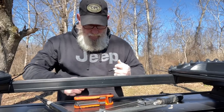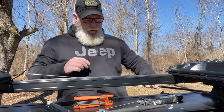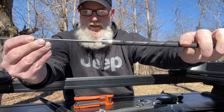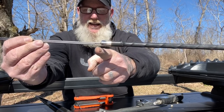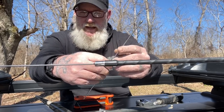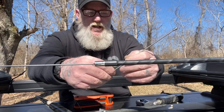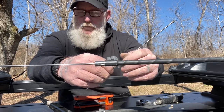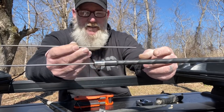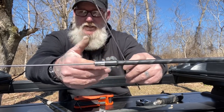I'm also going to take a black Sharpie and mark this piece of wire all the way around in case it ever gets bumped. The difference in length here is only about an inch — between what it needed to be and what came with the antenna. Could this have been a fluke where a short piece was put in the antenna by accident when it was packaged? Possibly. Could it be that it works for most setups and just doesn't work for mine and I needed that extra inch? That's possible too. I'm not knocking the antenna manufacturer — I just had to make adjustments, which meant spending five dollars on a piece of 1/8-inch steel rod from a hardware store. I suspect I'll find the same thing when I get to the 80 meter stick.